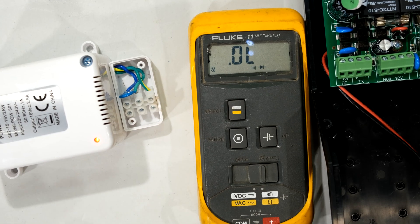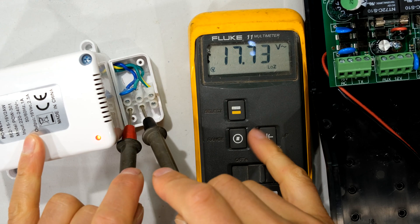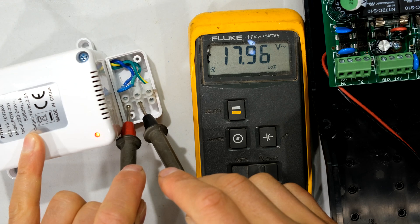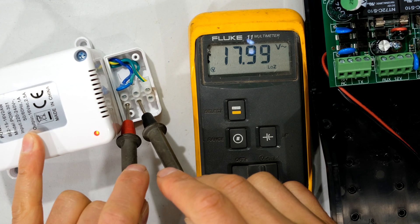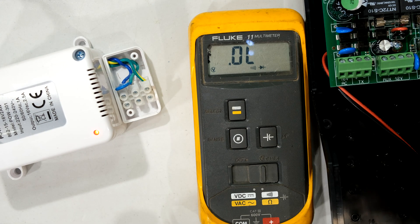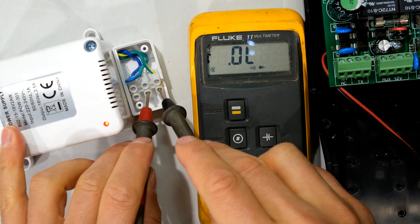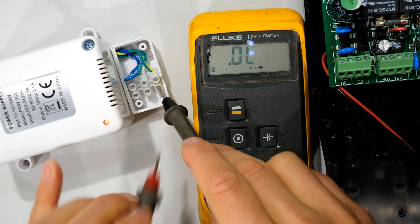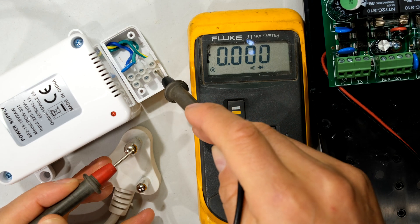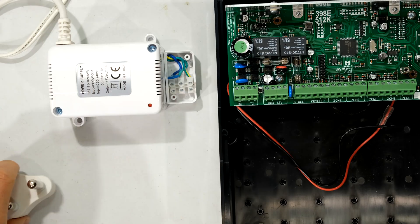If I plug this in you can see the little red LED. Taking a measurement of the AC output, I set my meter to AC volts — that reads 17.8 to 17.9 volts, so almost 18 volts. Yes, that's a bit higher than 16 volts, but once you load the alarm system this voltage will drop. The other connection here is the earth wire — measuring continuity to the earth pin of the plug confirms it. If you want to earth your system you can use that additional terminal.